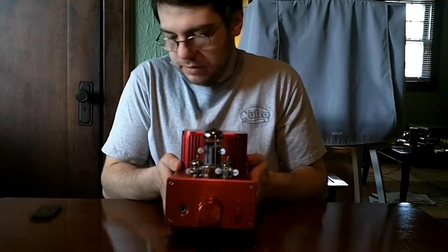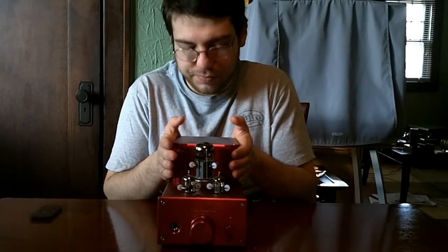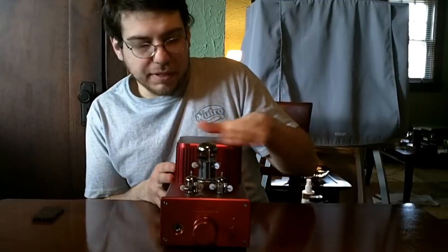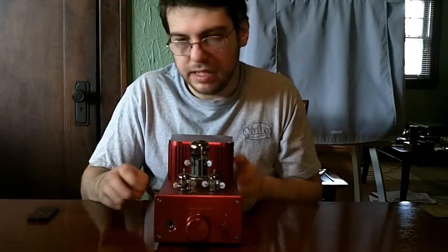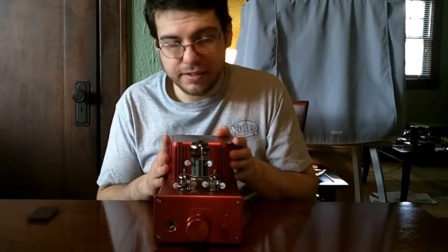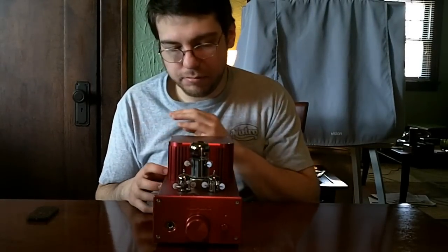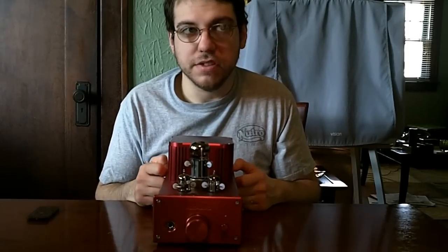Getting back to OTL design — I would only use this for high-impedance headphones, because I can't properly measure the output impedance with just a multimeter. It's going to be high — I'd say probably 60 ohms, maybe more. I would only use this with headphones in the 300 to 600 ohm range personally. Low-impedance headphones sound muddy, bloated, distorted, and super rolled off on this thing.